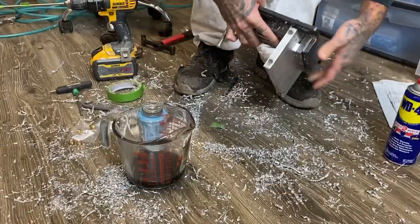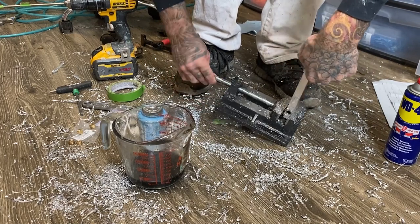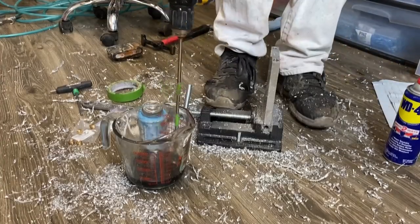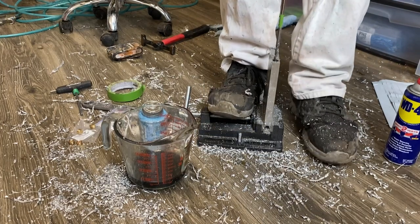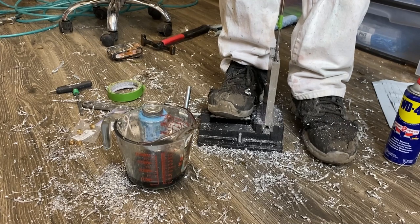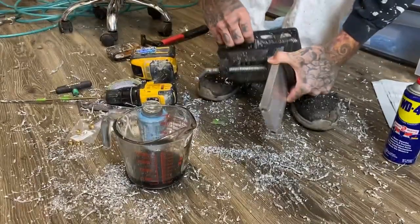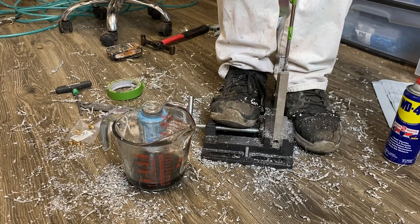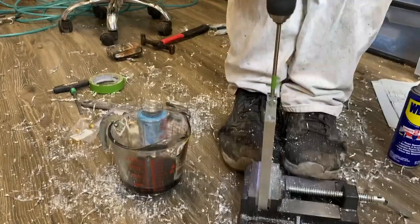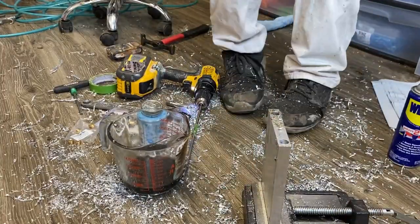That's about where we're going to leave it. Dump the shavings out and make sure the track is pretty clean. Now we'll start doing the long bores — get a little dab of oil. We're not going to stop on this one; we're going to stop on the next one. Once it gets down in there we'll know, but we should hit that opening first. It's extremely important to start this hole as straight as you can from the very beginning, because the plates can be hard and soft in different areas. The deeper you go, the more debris you get — you'll have to stop and dump it. There it is, we went through!